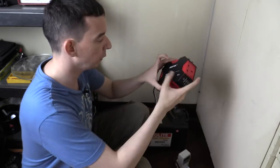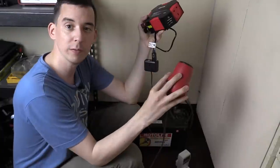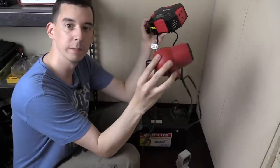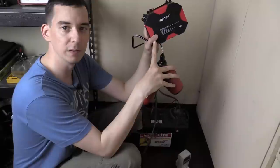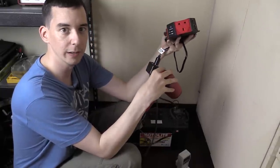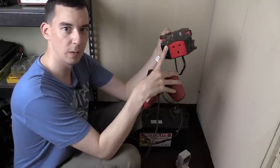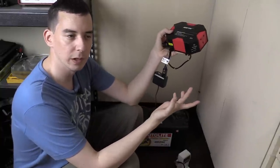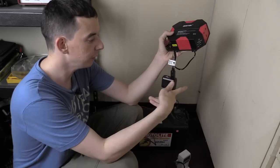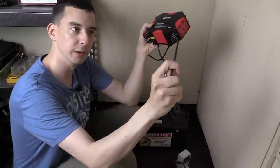Hi everyone, this is just a quick follow-up video. I did a review of this Bestech inverter a couple of days ago. One of the things I did was test if it could power a hairdryer. I never expected it to work because this is a 1000 watt hairdryer and this is a 400 watt inverter. I was expecting it to give a power fault error as a demonstration that when it's overcurrent it would turn off to protect itself. But then one of my viewers, Adam Welch, made a good point that perhaps the power supply I was using wasn't powerful enough, and perhaps the accessory socket I used wasn't good enough because the wires are just very thin.